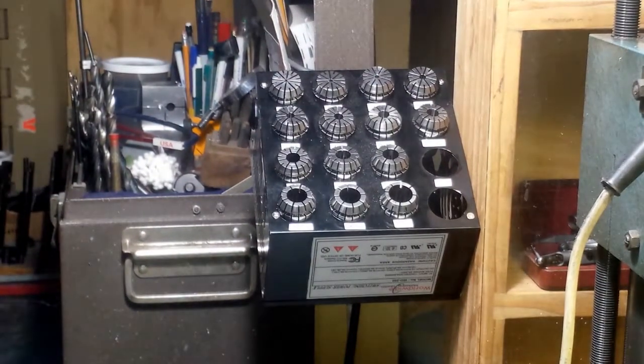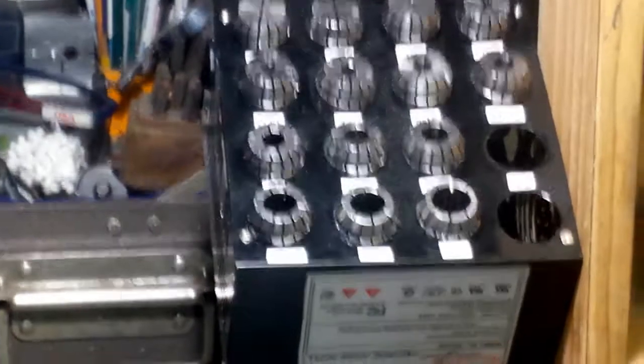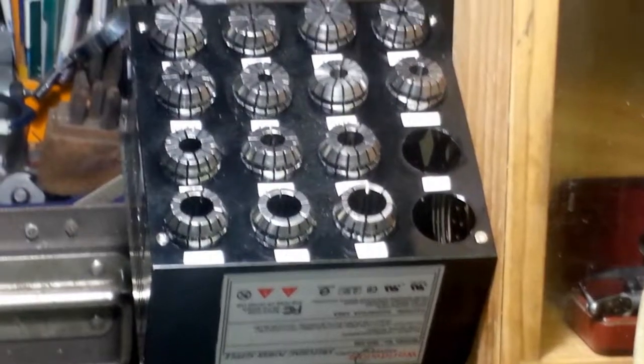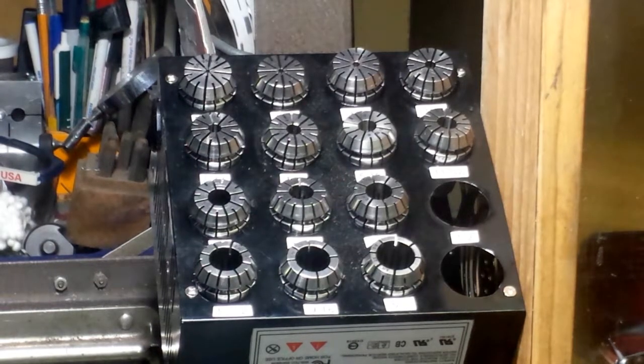While the camera's here, I thought some of you might appreciate — I just a few months ago got this ER25 collet. I know it looks funny hanging out of the lathe but it works well there. I have to adapt it to fit in the headstock, but it's a number two taper, so it'll fit in my mill head and the tailstock, and with the adapter in the headstock. I was always fumbling for the collet. You can see it's upside down, but that's all the information about wattages and power ratings on a computer power supply — I used that box. It makes a handy way to hold the collets. I'll get the valve cleaned up and we'll look at it after it's ready to go.